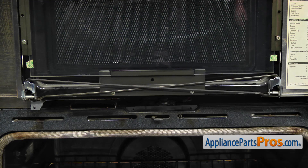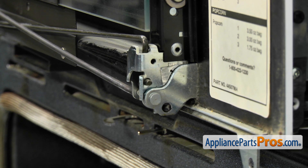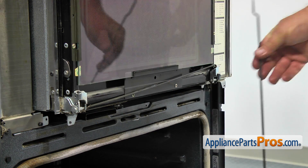Here at the bottom of the door you can see two cross torsion springs. One of them usually snaps at the curved end on the side, as you can see in our case. Push the end of the spring towards you to release it from the groove, then slide the spring out and remove it.